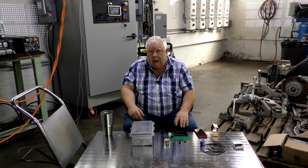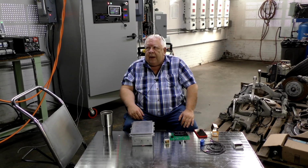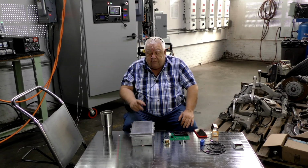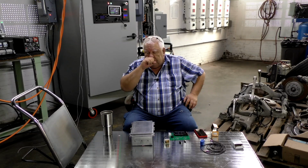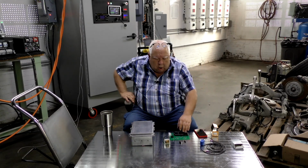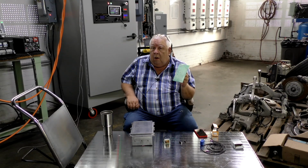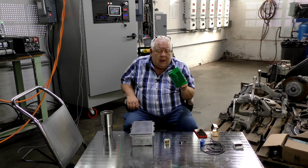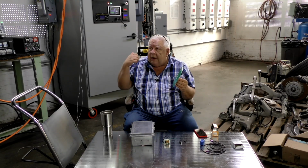Why do we want to put the data on CAN frames over UDP? Well, we may not be located at the main circuit breaker panel. This device has to be. These two transformers have to be there to make the measurements. You can't do it anywhere else. But our peak shaver or our time shifter or even our PowerSafe could be in the basement or in the garage or in the shop or in another room in our case. And so we need to have access to that data. This device will measure it and transmit it, but it doesn't really do anything because there's nothing I need to do at the circuit breaker panel.